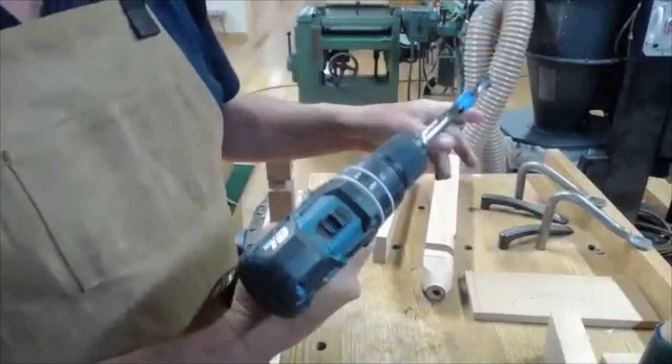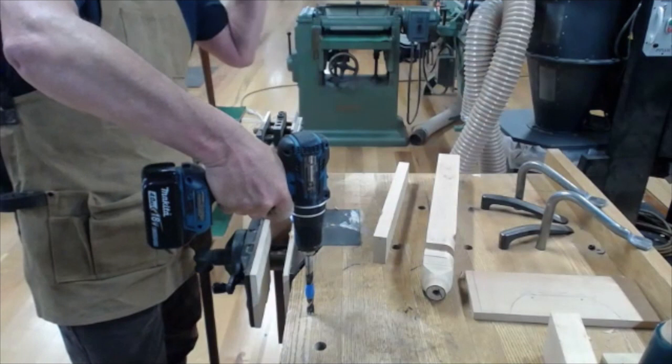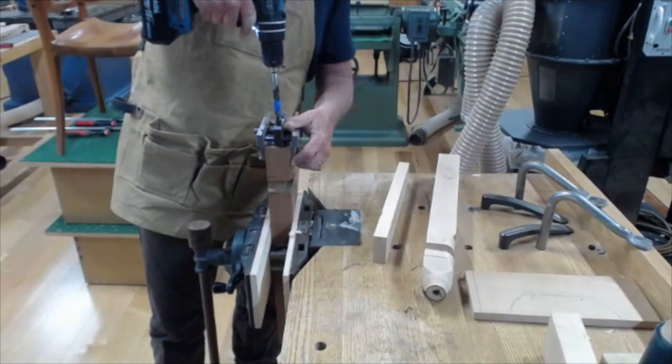The other thing is that you want the drill to be going at full speed. You don't want to be on your piece and then start. That's a rip out opportunity. You want to be off it, get the drill going first, and then plunge in. So what I do, we centered this, we lock that in, start the drill bit, and then plow through.